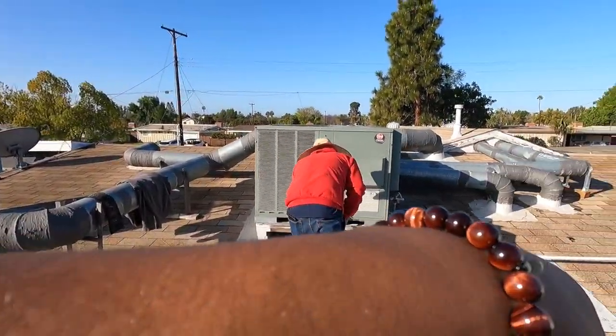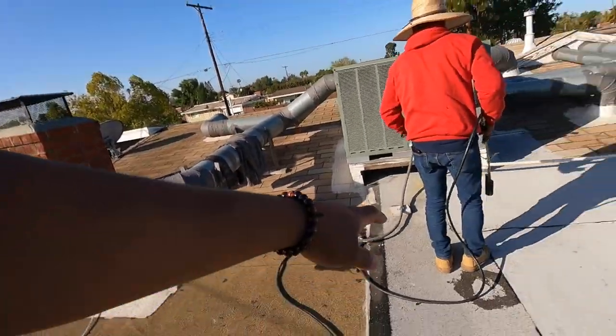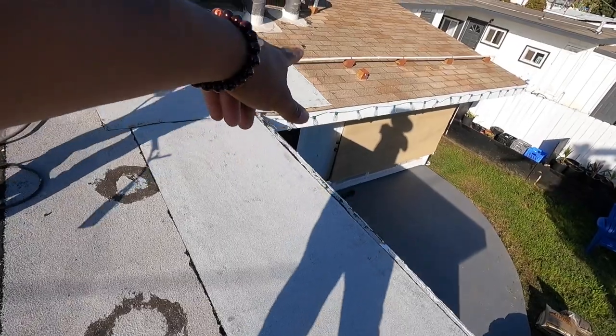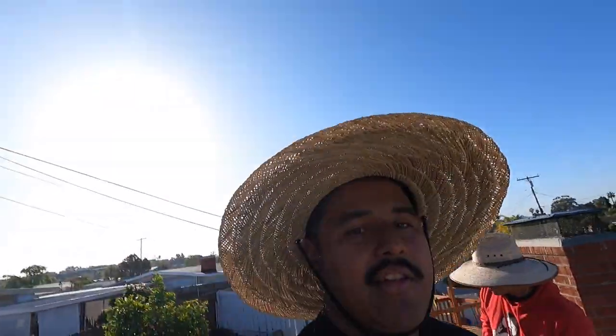This roof is not the newest roof, so that's normal for torch. They've got all these pipes for AC and stuff like that — all that leaked to this roof. It could be possible AC leaks, but this one's a roof leak just where it's at in his playroom or wherever. What we're going to do now is put mastic along these seams right here and on this side along those seams up there, and seal it off. And that'll be it, then we're off to the next one.